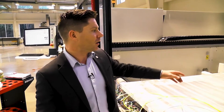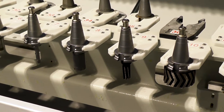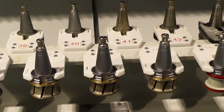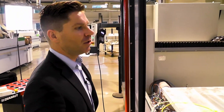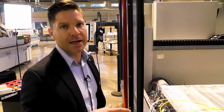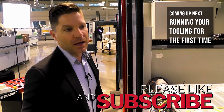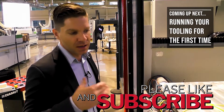Now looking at the tools we just placed in the machine, it's going to show from position number seven all the way down to 17. It's going to show the blind hole drill, then the core bit, finger bit, our power edge super Z, our first position diamond T33, our three flex version, position two, three, four and five diamond, and then position six and seven polisher. After you look at those tools, you'll see that position six and seven are fairly close in color — position seven is going to have a little bit more of a gray hint to it. So make sure the label and all the tools are identified clearly. Now we're getting ready to run the footprint and verify the setup, going one tool at a time through a verification process to make sure we make any adjustments before we move from there.